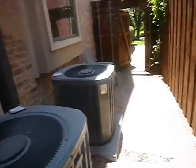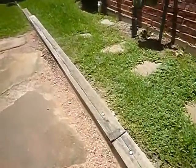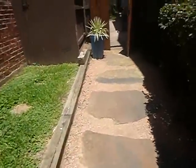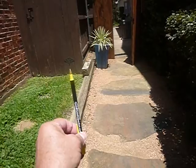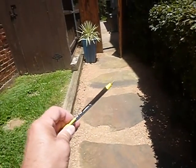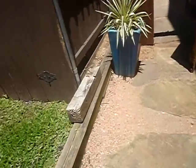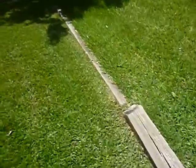Moving on along, more of those paving stones that we're talking about. We'll visit this stuff. Might have already visited it, depending on the order. These retaining walls, you have them on both sides, a little railroad tie, landscaping timbers. They last about 14 years. Now the rule of thumb is if it's more than twice its height from the house, 45-degree angle some people use, then in theory neither one of these retaining walls should have any effect on the foundation performance. So they're beyond the scope of this inspection. But they're old. Somebody's going to need to work on them.